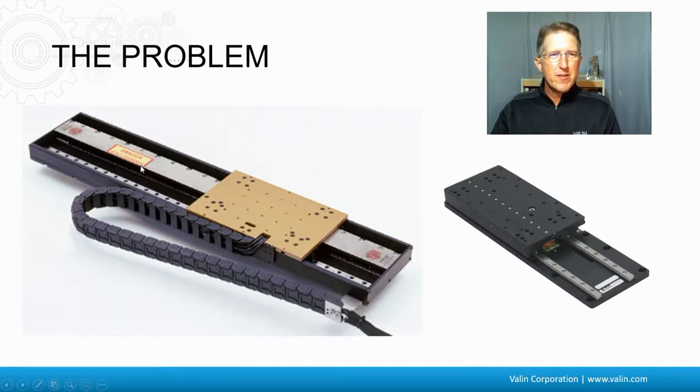Just a quick reminder here. This is a big series of magnets, and this carriage right here has a coil in it that slides up this U. So the magnets — in this case it's an ironless linear motor — it has a U, and it has an I that goes right up through those magnets. There's nothing touching there, and there's no mechanical advantage.